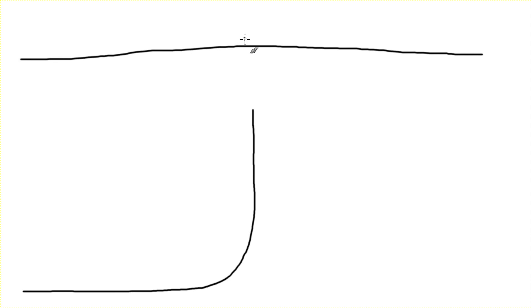So let's start with a basic dipole and my fantastic drawing ability. We have our antenna here, we have a balun here, and our feeder there. So this is a balanced antenna, centre-fed, as a dipole should be. Now we can move this feed point — we can purposely upset this balance. This is really a single-band antenna, although it will work on the harmonics of the band. But if we shift the feed point and use a slightly different balun transformer, we can transform the impedance so it's still a 50-ohm match. It's no longer balanced, and we will get related issues as a result. But we can now feed it on multiple bands.